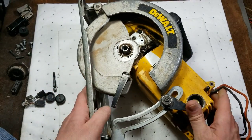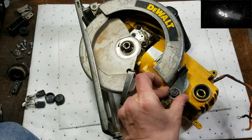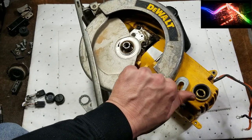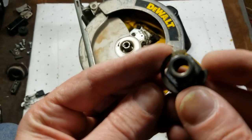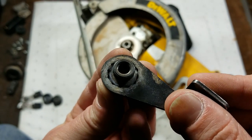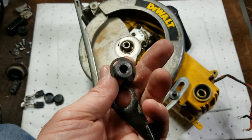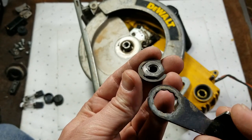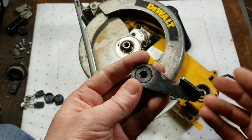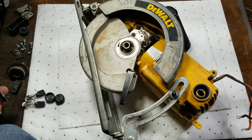Here's an interesting mechanism - it's like a nut over a hollow threaded dual threaded shaft. This lever is locked onto the shaft, and the wear is actually happening on a replaceable stud, just like a Skill saw. The notches let you loosen the nut and adjust this lever so it's in just the position you like. That's a nice feature, although it's simpler to do on the Skill saw because on the Skill saw the e-clip is on the front side - you just take a slot head screwdriver, pop the e-clip, adjust your lever, and push it back on in 60 seconds. On this one you need a wrench to remove the nut, so not quite as well thought out.